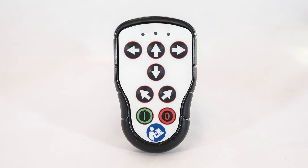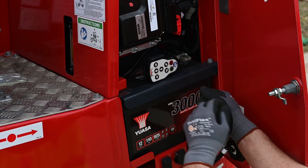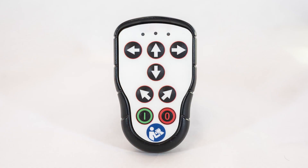Every RGM Plus system is supplied with two 8-button handsets which run off two replaceable AAA batteries. One handset can be stored with the forklift at all times in the specified area behind the rear access door, and the other at the operator's discretion. Each button on the handset operates a specific function during the mounting and dismounting process. To save battery life, a handset will deactivate after 60 seconds if no user input is noted.